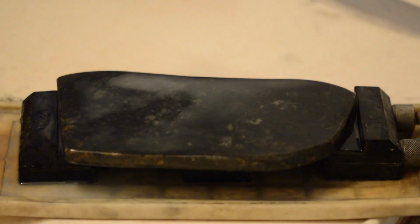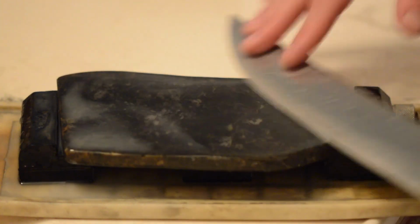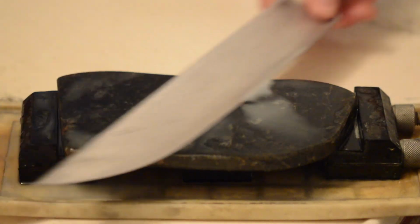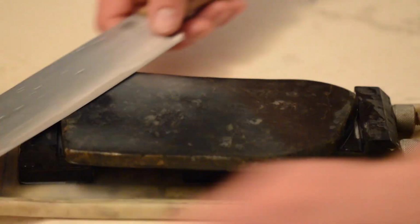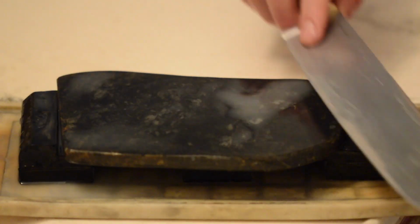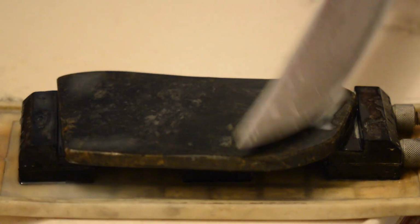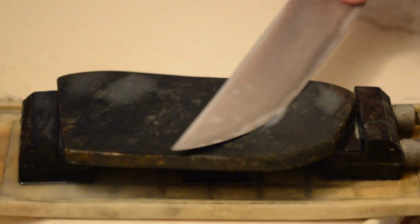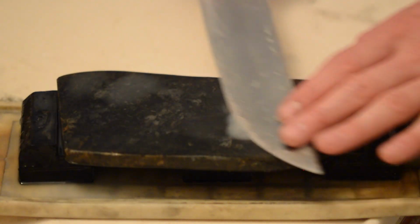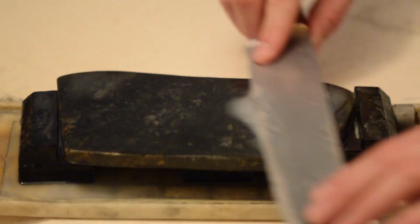It's not really going to make a drastic difference, honestly, which method here you choose if you want slurry. It's just going to matter which kind of stones you use. As a straight razor sharpener, I studied slurries a lot, and I found that it was a lot about having good technique and a fine enough stone that you're getting the polish you need. With knives, making a muddy slurry will definitely help you shine up the steel. So there's that. This is a really good base stone.